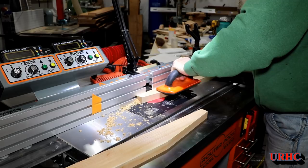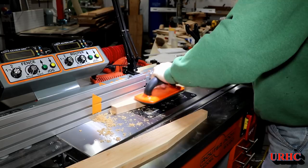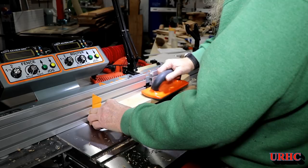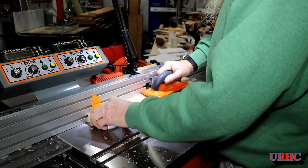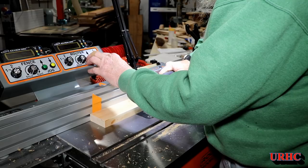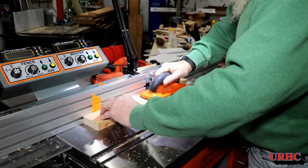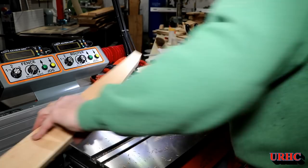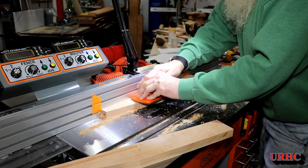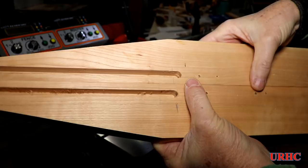One thing I noticed is when you're not cutting on the edge, the dust collection doesn't catch the sawdust the same way — it shoots out the end and can't get into the fence. Got the first quarter inch done, now positioning on the tape and bringing it up to 0.48 deep. Just hitting the button until it comes up to the number I want, then finishing off the groove with the second cut. That actually worked pretty good, though I'll have to look for some bits with better end-cutting capability. Both stopped dados came out perfect.